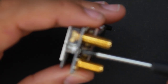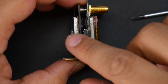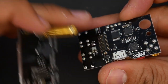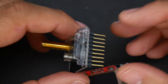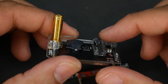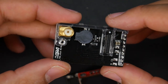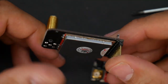In this part of the video, we're going to take it apart and look at some of the hardware components. We have a screw right there, so let me quickly remove that. As you can tell, we do have two receivers here — this is one receiver and this is the second receiver. Opening it up, you've got to be very careful because there are pins holding it in place in the middle — you don't want to bend any of these. Starting with the bottom board, this is in charge of sending all the video feed down to your goggles, possibly via SPI connections to allow channel changes through your goggles. The boards are lined with nice plastic pieces which keep the overall module very rigid and prevents flexing like some other modules on the market. We can see the little buzzer right here, and here's the connector which allows logic to pass through both boards, some capacitors, and one receiver connected to its antenna.